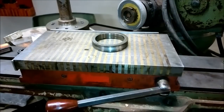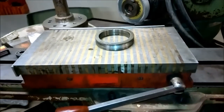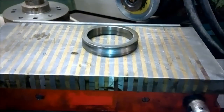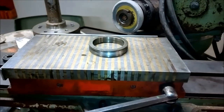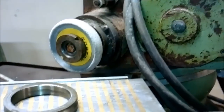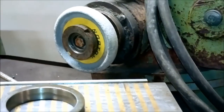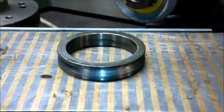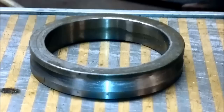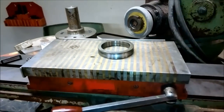And I think now I'm going to use my tool grinder for the first time ever to do anything serious. I'm going to use this rotary magnetic table, and this tool grinder, and a different stone than this to grind off the material of this shim piece. That's going to happen in the next video.